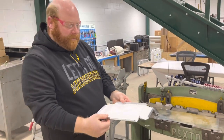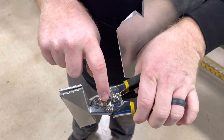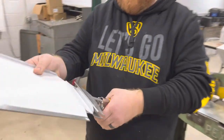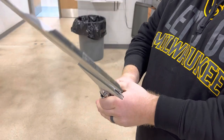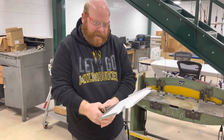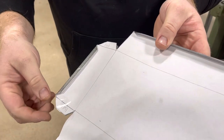Now what we're going to do is finish off the ends by taking the hand seamer. On the hand seamer there's a little locking piece that I've loosened up so I can get into it. All I'm going to do is put the hem inside the hand seamer and push down — it takes a little bit of muscle. I'm going to clamp that down, do another side. You can see how it lays now smooth and flat against the metal. The paper's in there — we can always pull the paper out later.